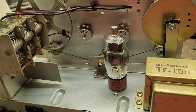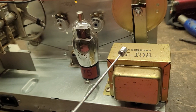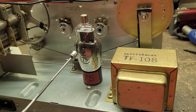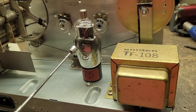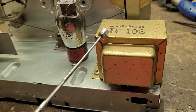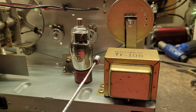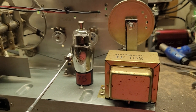I notice there's a 12-volt transformer — 13, 24 volt, whatever. But remember, I built a vacuum tube receiver a little while ago, the battery one, and it's only running on about 30-something volts on the plate. So I'm going to try again with this type 75 tube. I have an old transformer from an old CB base station unit, a TF-108, to get the voltage up a little bit. I'm thinking I'll build a little voltage doubler or voltage tripler to see if I can get the plate voltage to jump a little bit.